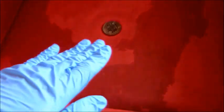This is a finished product. After you have Redguarded the entire thing, as I said before, 3 coats on the curb, 3 coats on the niche area, and 3 coats in any of the corners, and then 2 coats on the wall. All the way up to the drain surface, all the way into the crack in the back where the pan liner meets the pan floor. That all gets Redguarded. As I've said on a previous video, if you were really concerned about water getting into your pan material, you could theoretically run a bead of caulking up against that transition over there.